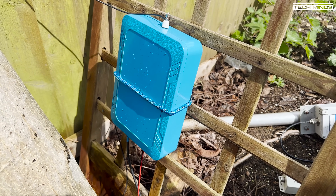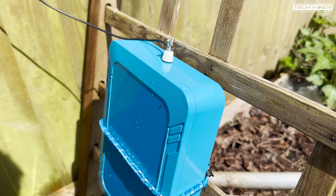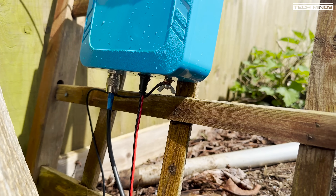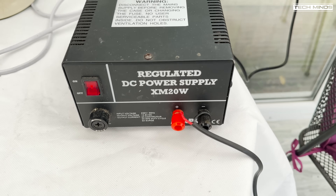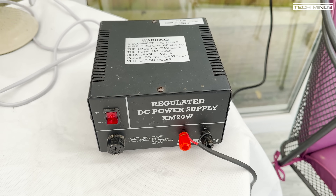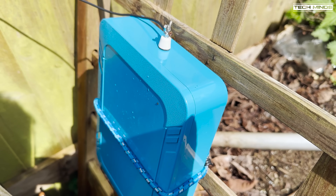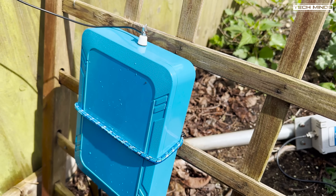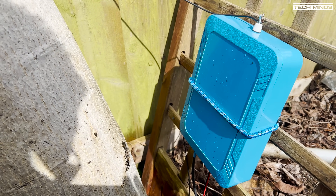Here we have it mounted outside. For this test it is connected to a 20-meter length of wire, the bottom earth lug is connected to a ground rod, and I've also got a piece of wire laid across the ground also connected to ground. It's powered by a 13.8-volt CB power supply sitting in my conservatory. When it comes to testing, I'm not expecting this to work on the lower bands — I've read that this tuner needs at least 40 meters of wire to cover 1.9 to 54 megahertz — but let's hook up the radio and perform some tests.